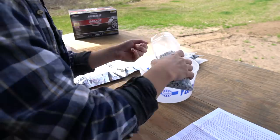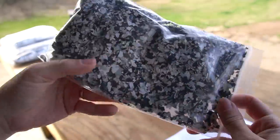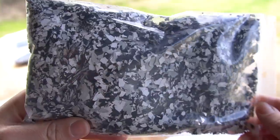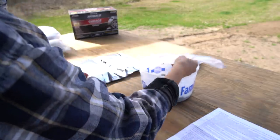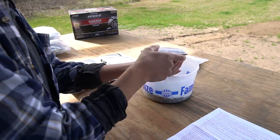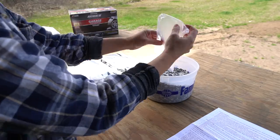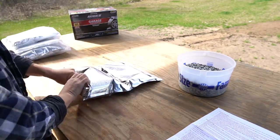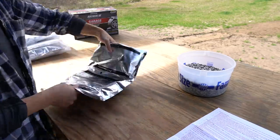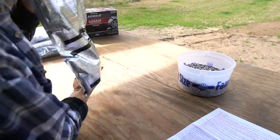Now I'm getting the garage floor coating kit all set up. I put all of the decorative paint chips in a bucket. For the RockSolid pouch, roll side A into side B to break the seal, and then the entire pouch needs to be mixed for 2 to 3 minutes.